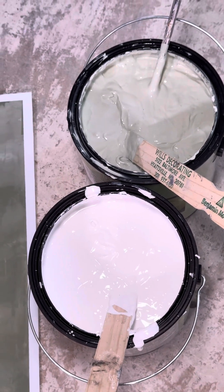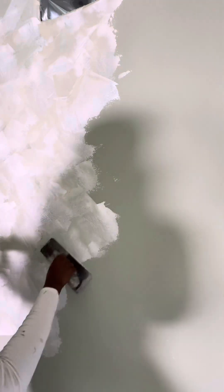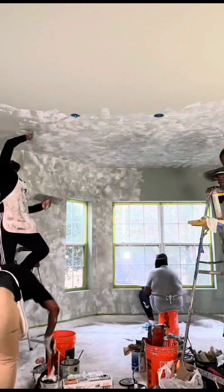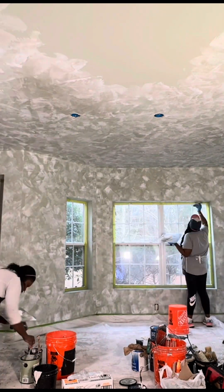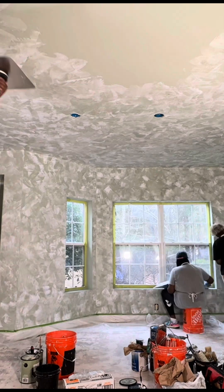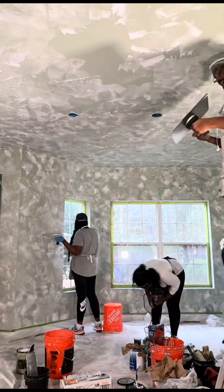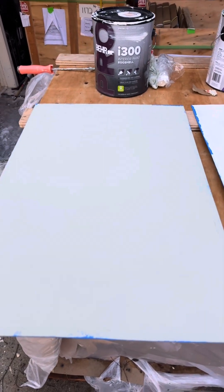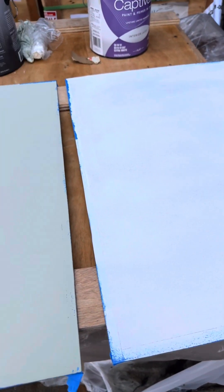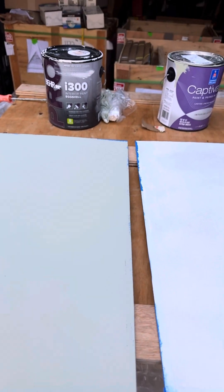Let's watch as I install my two-tone matte Venetian plaster. You can see I'm just working methodically down the wall, left and right, up and down. This first layer being installed is called a bladed skim coat, and I'm using both colors at the same time on this layer — we are covering the surface 100%. I sent everybody home with sample boards that fit into your portfolio. These are sellable finishes, so it's a really good experience to come in and work.